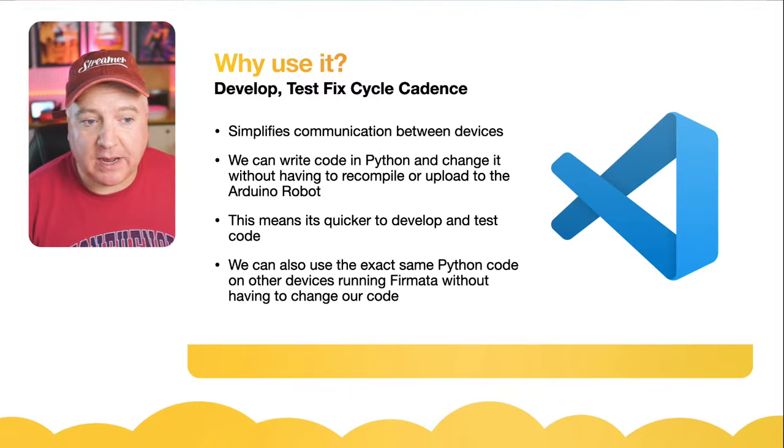So what that will do is it will create, I mean, I've already got one on here, so it won't actually do this, I don't think. Oh, there you go, it's already created one. So if I now do source venv/bin/activate, that will activate that virtual environment. So now when I type in pip install pyfirmata, it will now install PyFirmata in that virtual environment. I've actually already got that installed, so there's not actually going to be any change there.